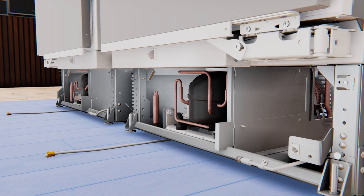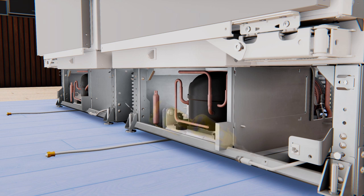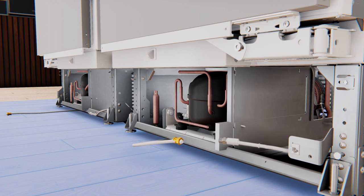To connect the water supply, locate and bring the tubing to the front of the cabinet. Remove the strain relief screw to allow enough slack for a proper water connection, and set the screw aside to replace later. Insert the molded end of the tubing into the refrigerator or freezer connection. Tighten the compression nut until just hand tight — over-tightening may cause leaks. Repeat for the second unit, then turn on the water and check for leaks.